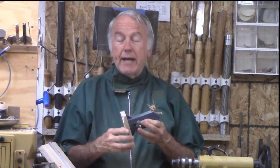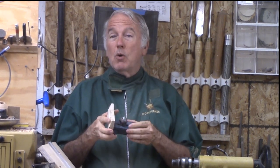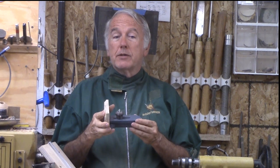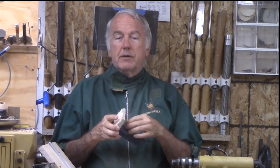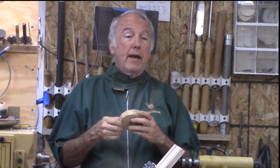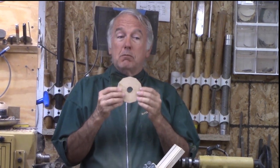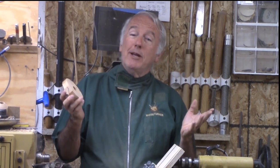To gauge the length of a segment, I use a simple depth gauge that I clamp to my rip fence. It is adjustable, but I rarely take it apart — I just use my rip fence. With these tools, I am able to cut and make a perfect segment or ring in very short order. The key part borrowed from the pattern maker is the rubbed joint, where I use less glue and get a chance to inspect each joint and bring it to completeness very quickly. I will show you all this in the video and I hope you can enjoy segmenting too.